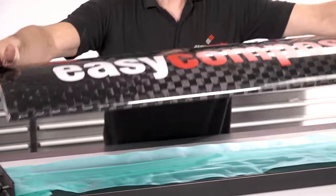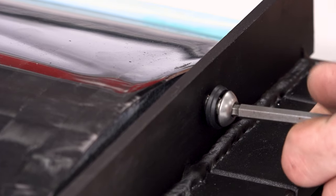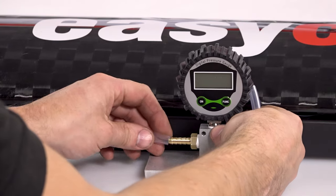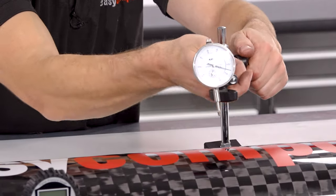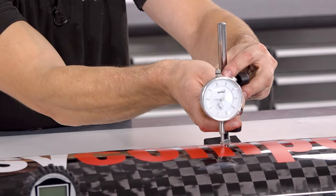The wing element can then be bolted into position. Due to the stiffness of the test rig I'm using rubber washers in the mounts to allow for a degree of movement as the wing flexes. The digital pressure gauge is installed in line and then connected to a pressure source. To measure how much the wing deflects I'll use a dial indicator — a destructive test like this could be unpredictable so I'll just use a basic instrument on a magnetic base.